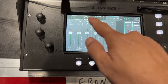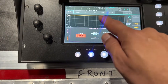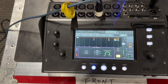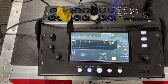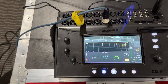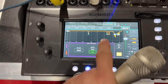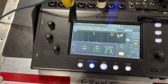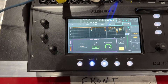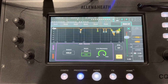I'll turn this up a little bit to make it a little bit easier and go back to my output processing on my main left-right. So that pulled out some frequencies. Now watch this — if I switch to live mode, it's going to keep my fixed frequencies there, but the live filters are those additional frequencies and it will let go of them when it doesn't hear that note anymore. So I'm going to put this down in the horn again. You can see it grabs those frequencies and then watch them go away.